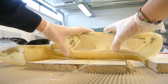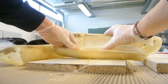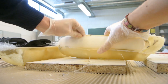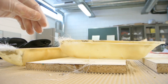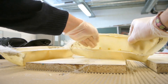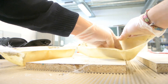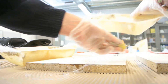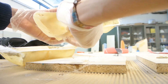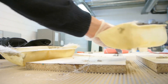You might have some flanges of resin going onto the inside, but that isn't a big problem — it can easily be sanded or cut off. Here I'm removing the parts; it's easy because there is some flex in the part. If it were a rigid piece I wouldn't be able to remove it, so that's very important to keep in mind. At the end you remove all the excess still left in the mold, and you should have a nice mold at the end.